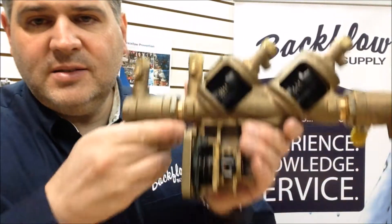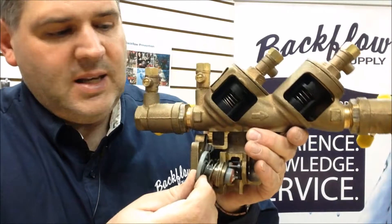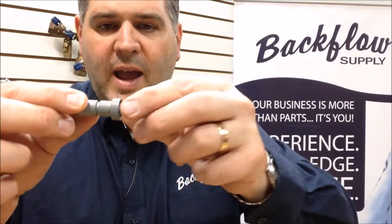The other issue with the RP4A is that because of that wall, if there's still water trapped in there, this relief valve assembly has nowhere to go. The water expands and snaps the stem. There's a stem that runs underneath everything — the red gasket attaches here, this plate attaches here, and the bushing rides on an o-ring right here. Right where that o-ring goes is where it tends to snap. You can replace the stem only, or you can replace the whole relief valve assembly.